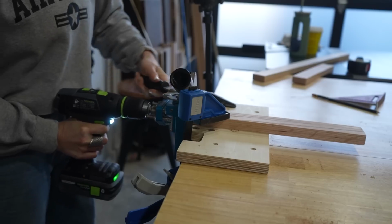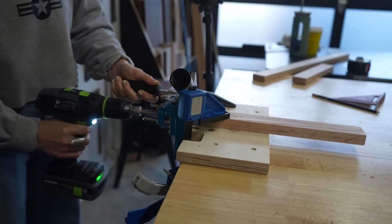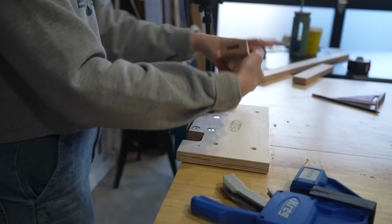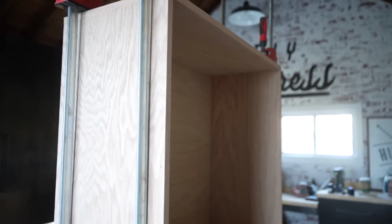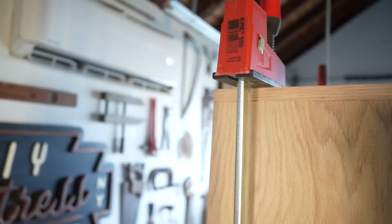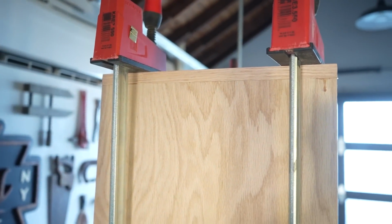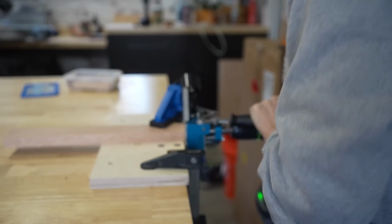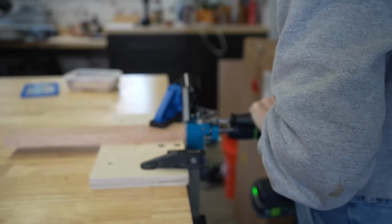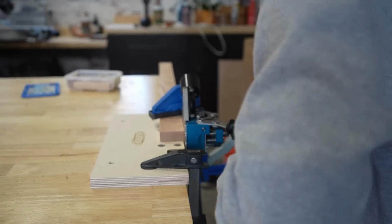Well, when you're limited to using 3 tools like a circular saw, a drill, and a sander, I would highly recommend investing in one of those accessories to help with actually assembling the doors. For the cabinet carcass itself, you can kind of get away with some screwing and gluing, but when you're making door frames for cabinet doors, it's a little bit trickier and you want everything to line up the right way. So if you are going to be using 3 tools, I would say getting a good pocket hole jig or something like the Mortise Mate will really help to make that process so much easier.